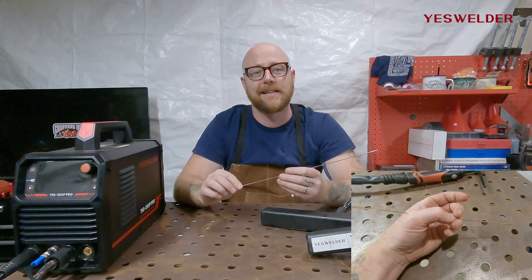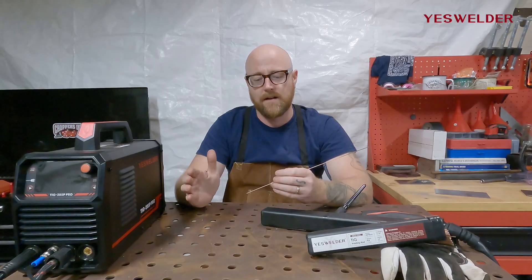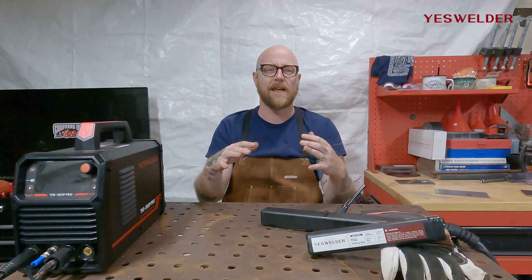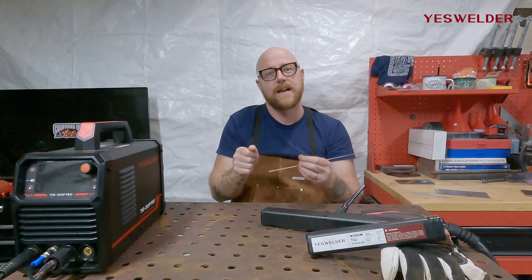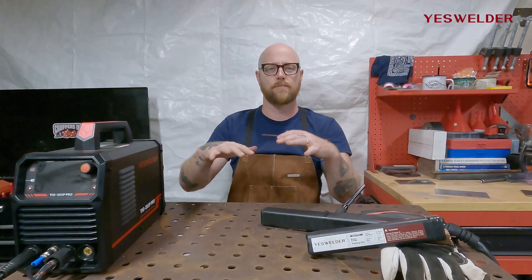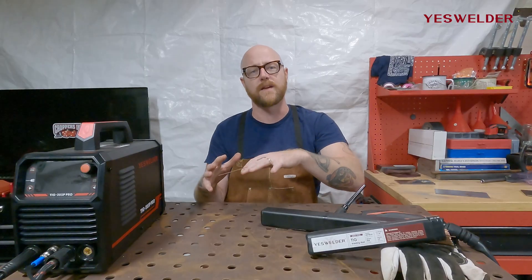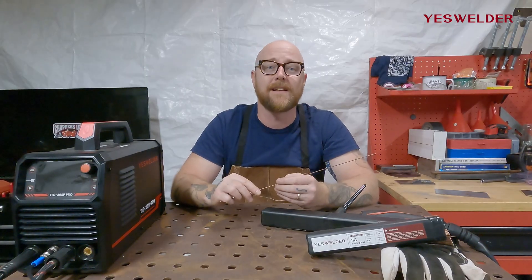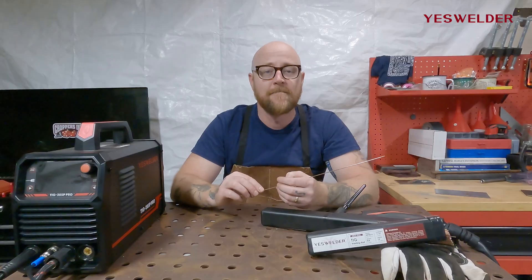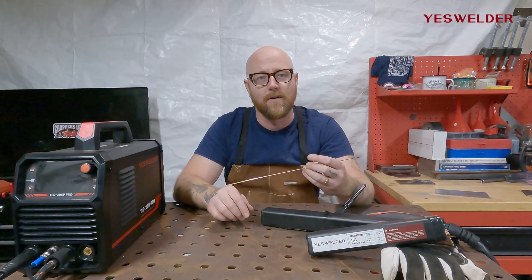I like the hybrid method because it allows you to feed filler rod faster. When you're doing a weld and everything's starting to heat up and get a little too watery, you're about to lose control. Being able to speed up and get the maximum amount of filler rod out lets you get ahead of that super-hot watery weld and bring things back to a nice level of material heat and travel speed. The main thing when feeding filler rod is consistency — making sure you're consistently driving the same amount in the same time pattern throughout.